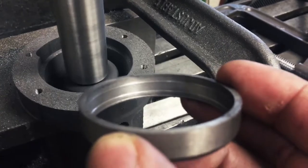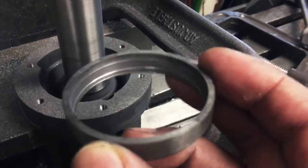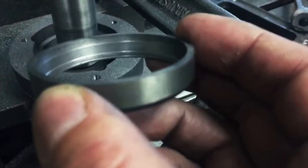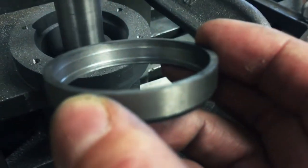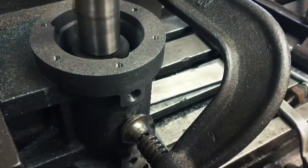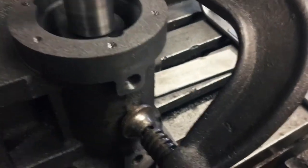exactly what I wanted. Yeah, you see it? A couple tries until I got it out right where I wanted it. Then I locked it in, and this is a one-shot deal. It's bore in one shot. I'm gonna go down and just lock that out to 2 inches. Shouldn't be a problem. It's a light cut.